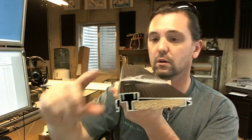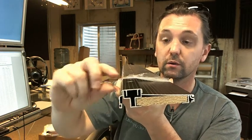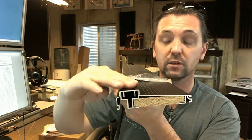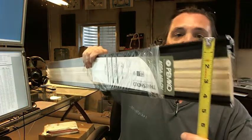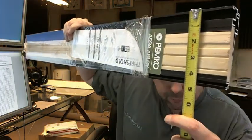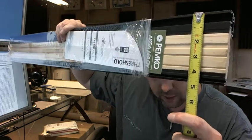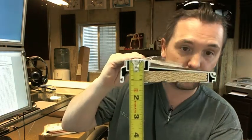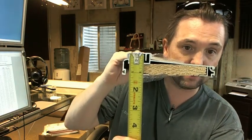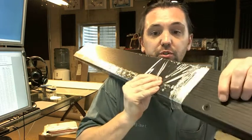Adjustable up to an additional quarter inch from its lowest point, which is an inch and an eighth. Let's get the tape measure — there's also an image below this video showing you dimensionally everything important about the threshold. We are at four and nine sixteenths width, which is very common for residential thresholds. We've got inch and an eighth over here at its minimum.